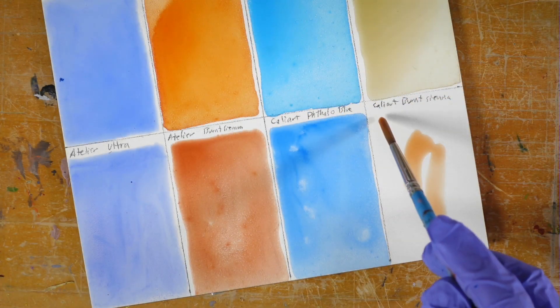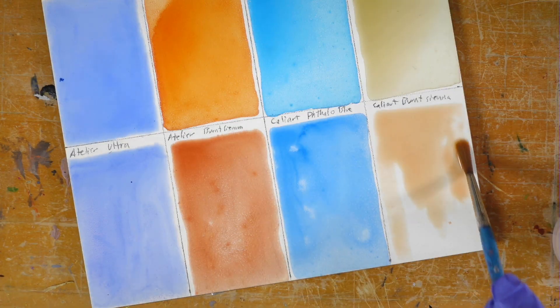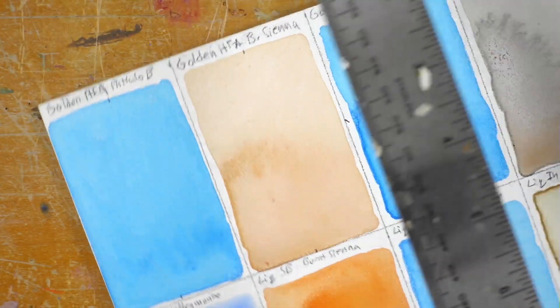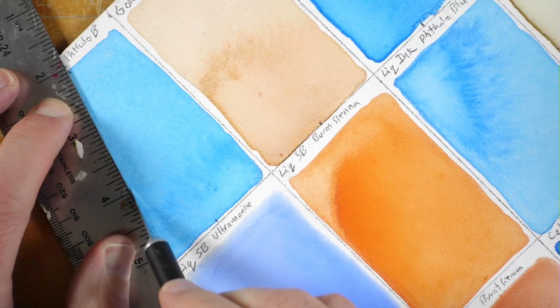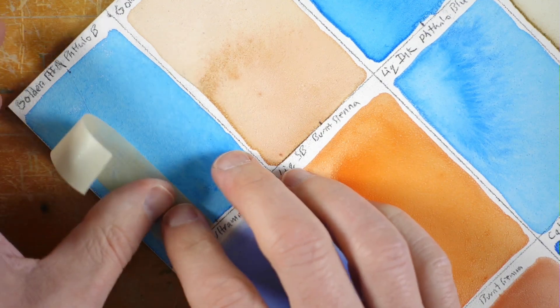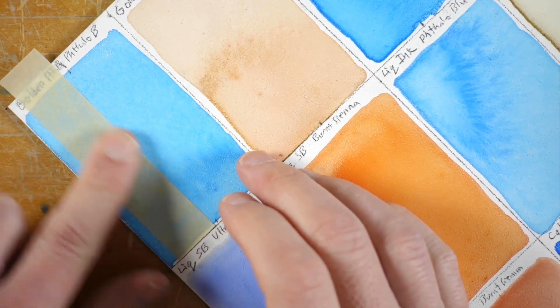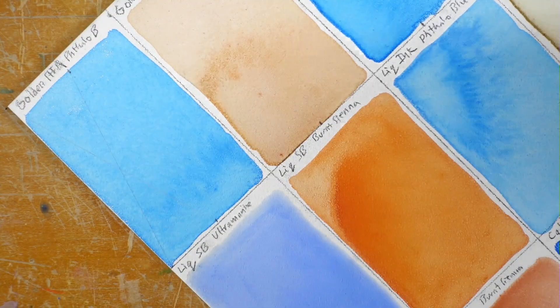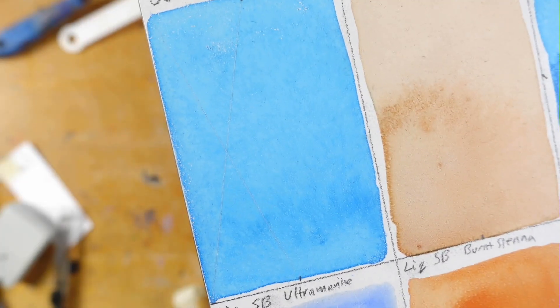I let the paint dry for over a week to make sure it's fully cured, then I followed the ASTM D3359 adhesion test. The test consists of cutting an X through the paint film, then applying masking tape over the cut marks. After waiting a minute, you pull off the tape. The ASTM has five classifications for the results — I can't show them here because their documents are copyrighted — but I would say this passed. There's no paint that peeled off, and I don't see any jagged edges around the X. Here's a close-up of the cut marks and you can see the paint's not peeling up around the edges.